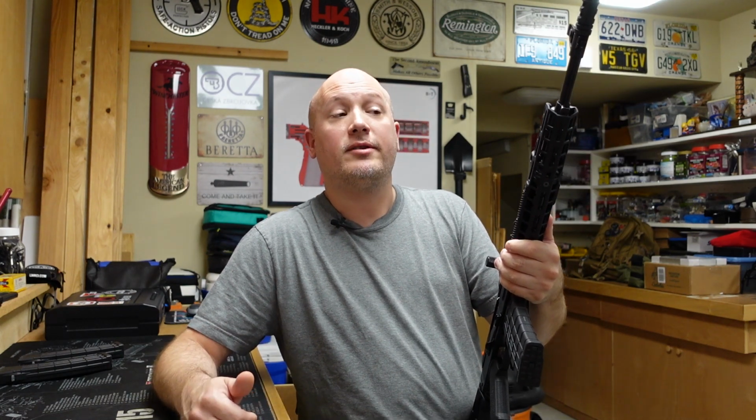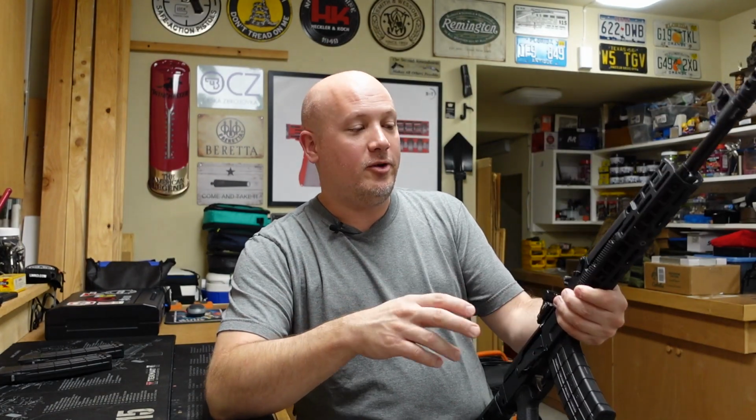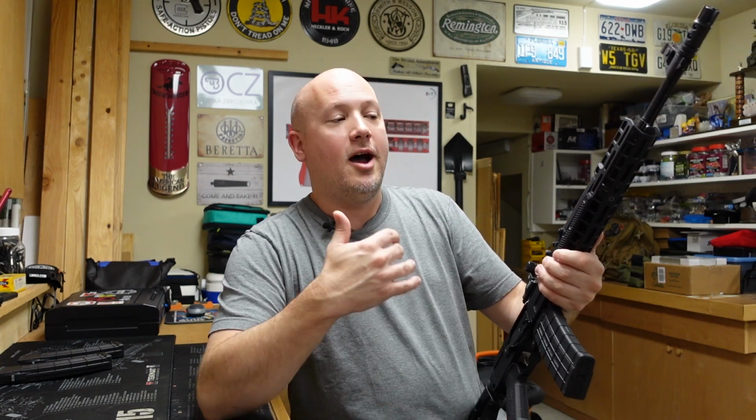Now, I was aware of this problem, and Charles reminded me about it: these AKs are a little bit overgassed. When they make the SAM5s, maybe it's because the Arsenal factory in Bulgaria is so used to making AK-47s chambered in 7.62x39, when they drill out the gas port, it's a little bit too big, and these things are notoriously overgassed. So it has a little bit more recoil, you feel that gas in your face, and it can damage the receiver over time. So a lot of people do put in those adjustable gas pistons, and that's what he did.